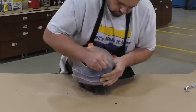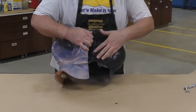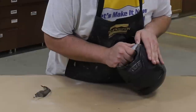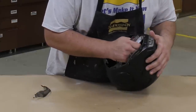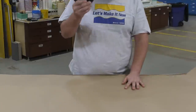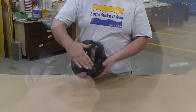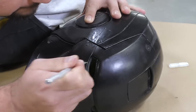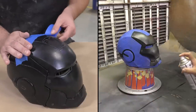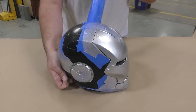It's really nice to have a glove mold like this because there are no seam lines on the actual casting that you have to touch up. The only finishing work is trimming the opening where we poured in the SmoothCast, as there will be a little material spill there. You can see that the 57D is really impact resistant — it has some give to it. To finish the helmet we'll cut out the eyes, vents, and mouthpiece, then mask the entire helmet and paint it using acrylic paints.